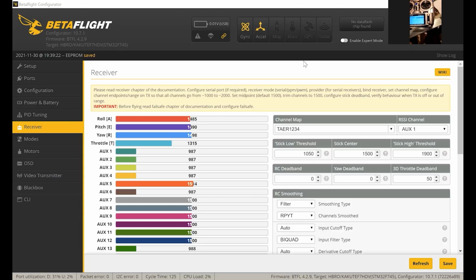There we go. Click the jog wheel. Click the jog wheel, Thomas. Now press enter. Now the first thing, maybe have one of you hold the camera while the other does the stick. Now the first thing you're going to do is center the sticks and center the potentiometers. Up with the switches, the potentiometer as well. So you don't need to center the switches. The switches don't need calibration. Just the potentiometer knob.